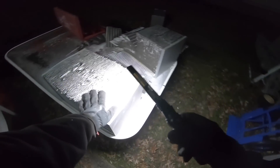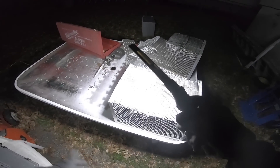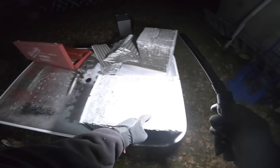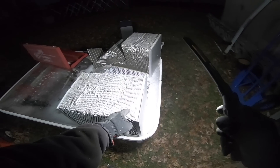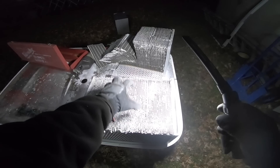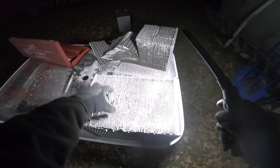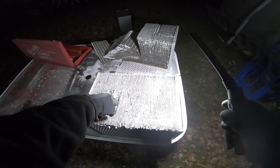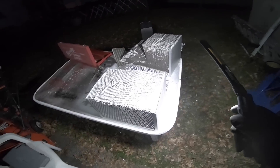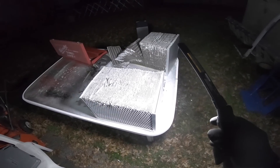Put a pre-filter before it, and then we won't have to replace these going forward, because these things are not cheap — the pre-filters are $450 to $500. It is solid — doesn't seem like it moves. Make up your own mind. It is a lot of filtration going on in here, though. You also have MERV 16 before this — four MERV 16 filters are supposed to be before this, capturing dust in the air. Whatever they don't capture, supposedly this will. But the MERV 16 should capture almost everything anyway. I heard this is meant for like a hospital clean room or something like that.